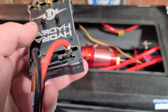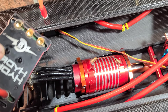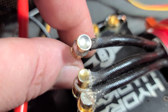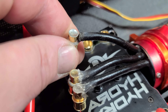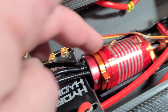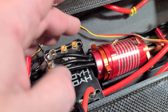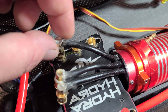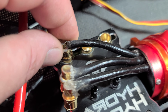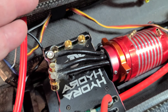The second thing you have to do if you're running this combination with the XLX2 and the V1 Leopard Hobby motor is solder your bullet connectors on basically sideways. Don't go in from the top — go in from the side. The motor wires on this motor come short, so you're going to have to solder at an angle so you can get your motor wires into the ESC without bending at a 90-degree angle.